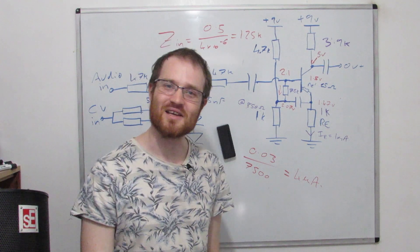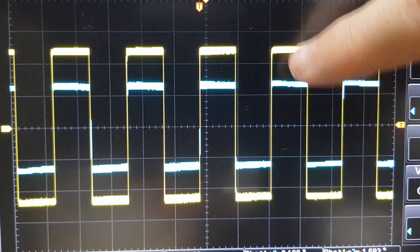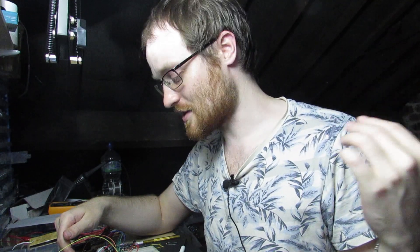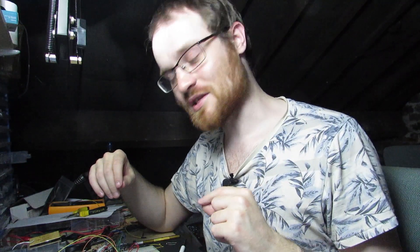Back upstairs — we're still getting some attenuation, so it's not ideal, but it's much much better. Comparing input to output, we've got a one-volt peak in and just over two volts peak out. We need to either improve the gain of the amplifier and accept some loading from this particularly tricky source, or improve the input impedance further with other techniques. Over the next couple of videos we're going to look at high-gain amplifier circuits and their limitations, and then negative feedback — feeding the output out of phase back into the input — which has lots of benefits of its own.